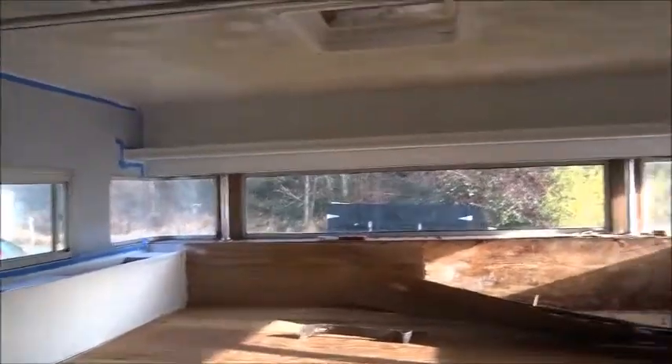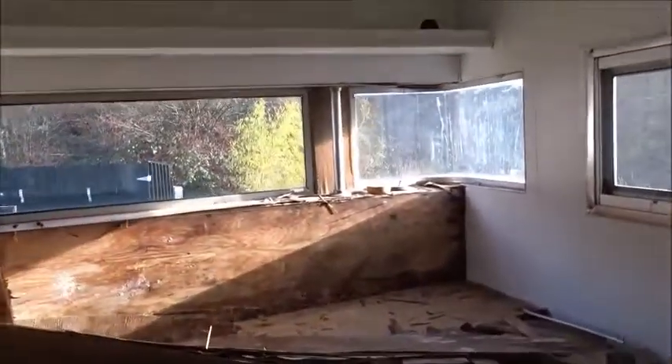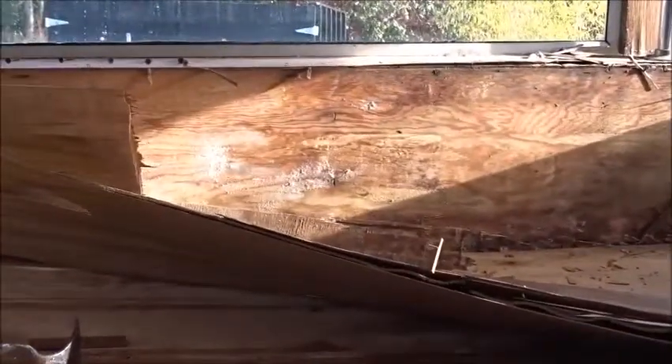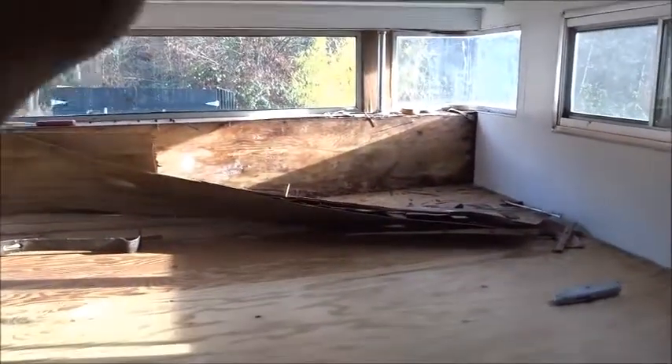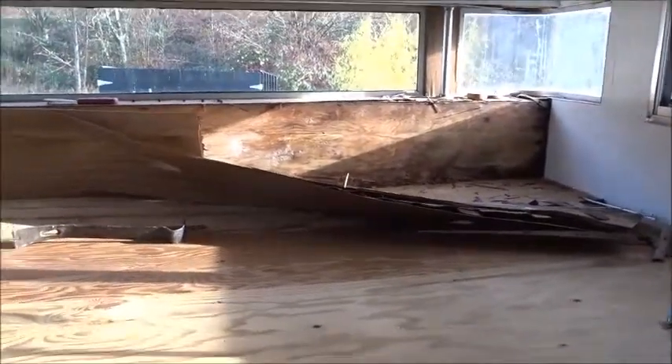Alright guys, we've got a bunch of this painted up top right here and right here. I knew there was a leak in the past and I didn't realize that there was a bunch of mold behind here and underneath — the whole floor in the corner right there. So I have to take up these pieces of plywood, rebuild anything that has been rotted out, and reseal everything so it won't mold, and put new plywood in.